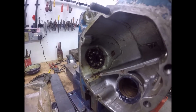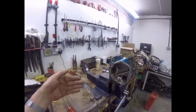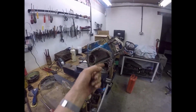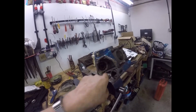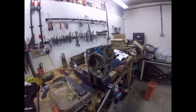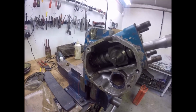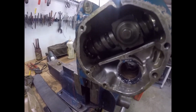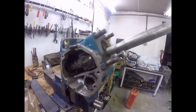Right, the next thing I have to do is to get this assembly here, thread it in through there and up there, and then drop the bottom of the worm into those bearings without dislodging any. So that's what I'm going to do now. I'll be back in a moment. Right, so far it's a goodie. It's all in place and it seems to be good.